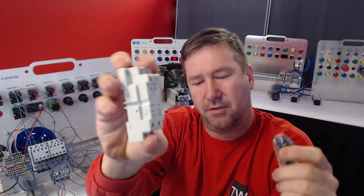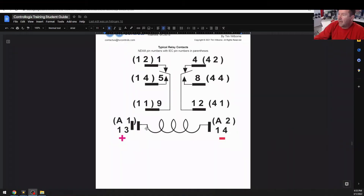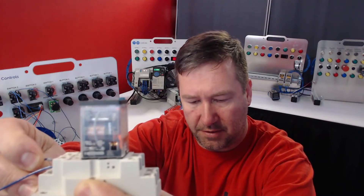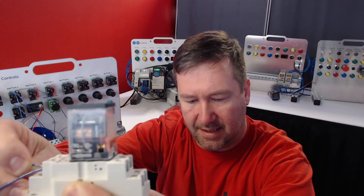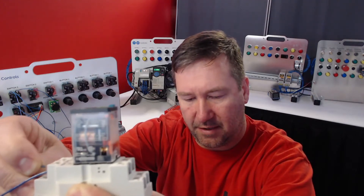Most of your relays come in two pieces: you have a socket and then the relay. If we look at a diagram of it, we see that there is a coil of wire here. If you energize terminals 13 and 14 you'll create a magnetic field and that's going to shift these contacts. Taking 24 volts to terminals 13 and 14, you can see the contacts shift along with the LED indicator for that coil.